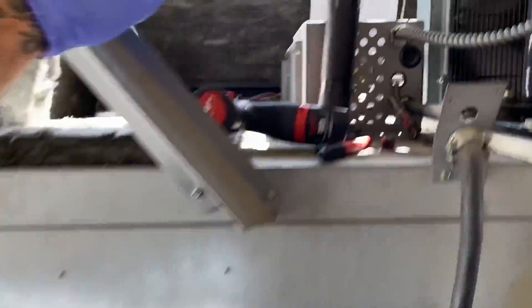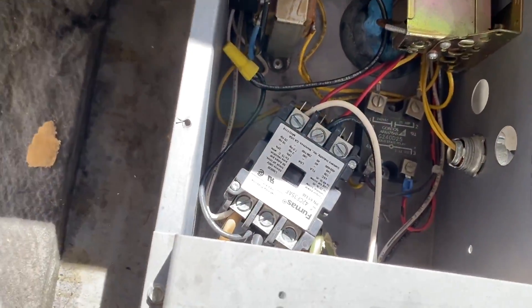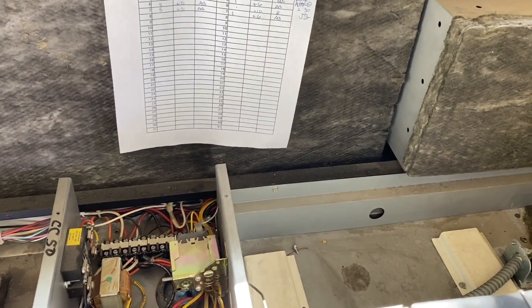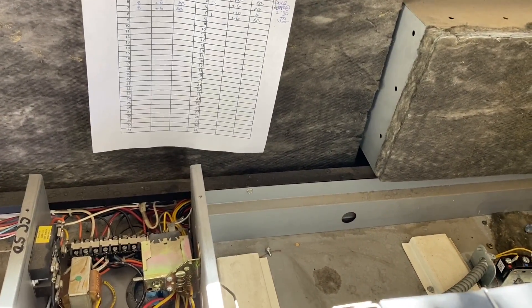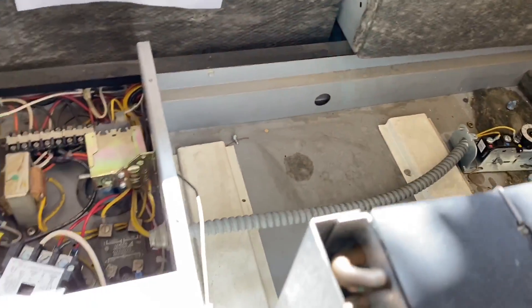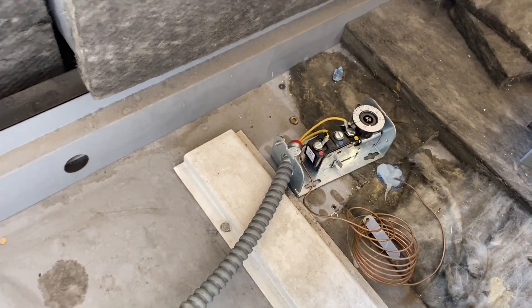I'm going to install a thermostat with defrost - the A421 ABD02C. I'll show you guys how to do that. It'll be easy on this one because this unit already has a contactor for the compressor right there. We already got the wire right there, we can fish the neutral through, and we already got our hot switch leg right there. So we're good to go.